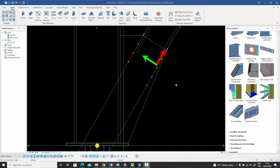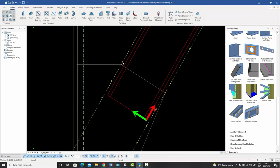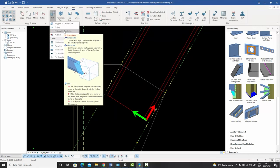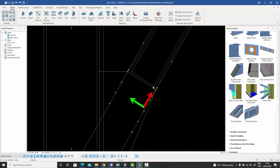Now that I have my gusset plate ready, I can fit the vertical brace to the 10mm line. I go to the Edit menu, select 'fitting with two points', select the bracing, select the nearest point to the fitting, provide two points, and my bracing is fitted back to that point. Now I can create the two plates coming out of the brace into the gusset plate. I go to the Steel menu, go to the plate command, and start entering the plates.